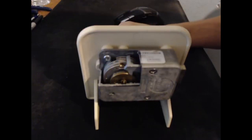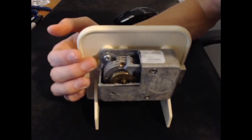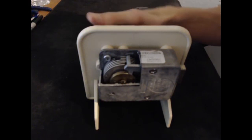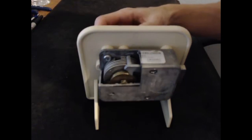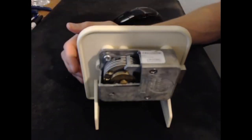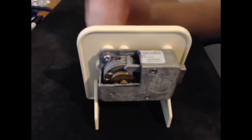The wheels are named this way because the first wheel corresponds to the first number in the combination. Since it is the last to get picked up, it is set first. So you can freely work with the other two wheels without upsetting the position of that first one. The third wheel gets picked up first — corresponding to the third number — then the second wheel, then the first.